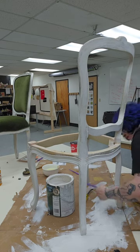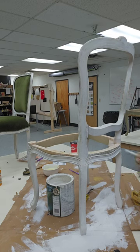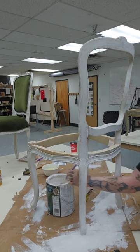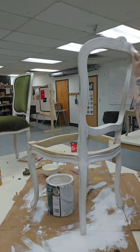Just so I get this frame ready for fabric here in a little bit. This is how I finish projects. I give them a quick finish that's going to be a lasting finish that looks really good with the new upholstery without it taking me 24 hours between coats. You lay it on in layers so super thin that they're drying in between and building up. You can't leave a fingerprint in them. They never get that tackiness. They just sort of dry right up. Of course, I'm using flat paint, that helps.